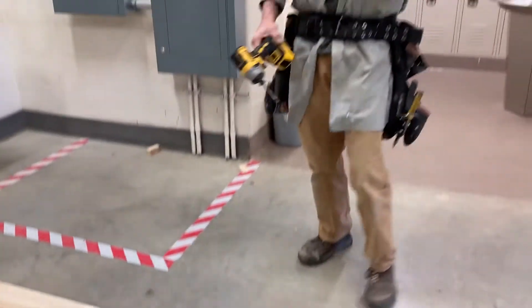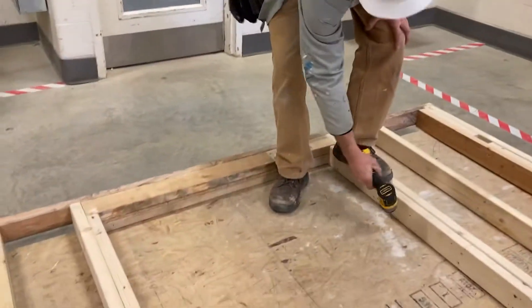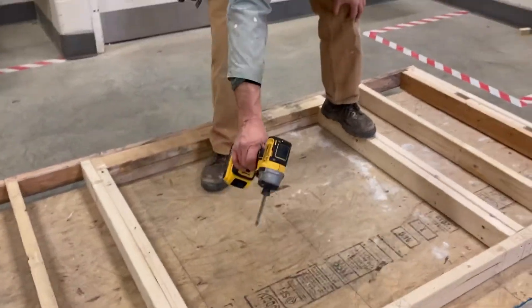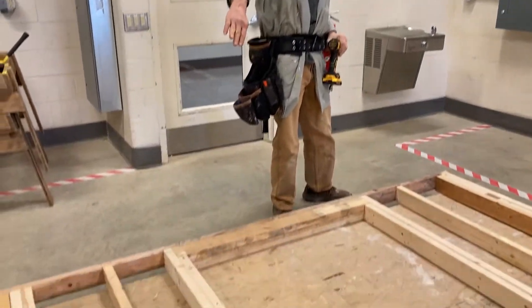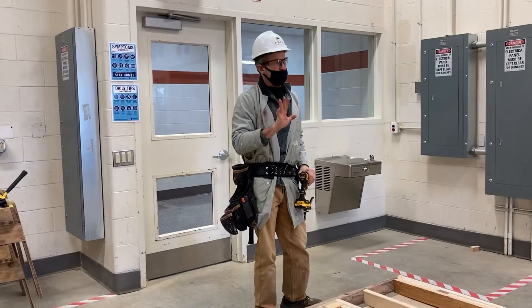These guys have just finished building this. This is our door rough opening — in between our jack studs we have 38 and a half inches, just like we laid out. They're getting ready to put their wall sheathing on, and one of the most important steps to remember before you start putting wall sheathing on is making sure that your wall is square before you do that.